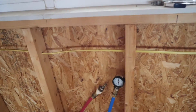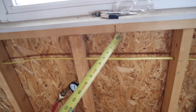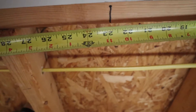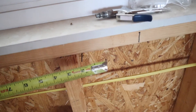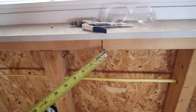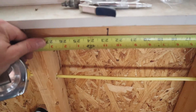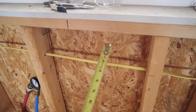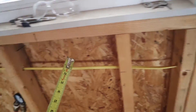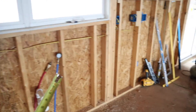Here's a code issue I had. The center of the sink to the sink base edge puts me at just under 24 inches — that would be fine if that were the edge of the sink, but that's the sink base cabinet. A standard 32-inch sink would end beyond the two-foot mark, putting me out of code. So I'm going to get a 36-inch sink so it ends right at the edge, putting this outlet only 23 inches away and meeting code. Otherwise I'd have to mount an outlet horizontally to get it closer to the sink, which I don't like the look of.